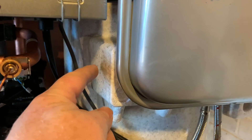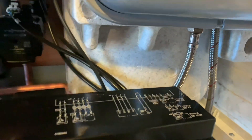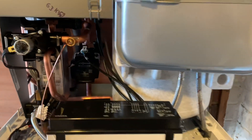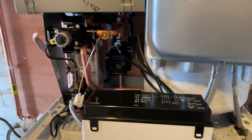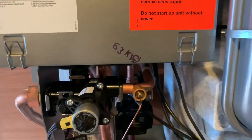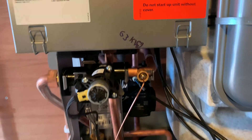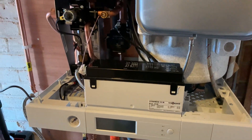That inlet is slightly lower but goes all the way up into this tank, quite high up, so that you're not drawing off cold water from the bottom. This cylinder will recover in about seven minutes from totally cold. One thing I've written on here is a reminder: this boiler is 63 kilograms when empty, so it's quite a heavy boiler.